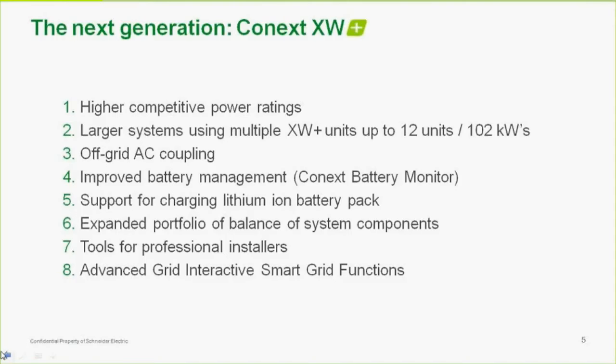Now, if the grid was to go bad, the generator slowed down, what have you, and the inverters were to disqualify that source, then there's no way that we, or any other inverter manufacturer, by the way, can guarantee that all those relays will open at the same time. So the last one that opens up gets to carry the brunt of the current. Remember that a 60 amp maximum relay carrying 192 amps is a recipe for potential problems.